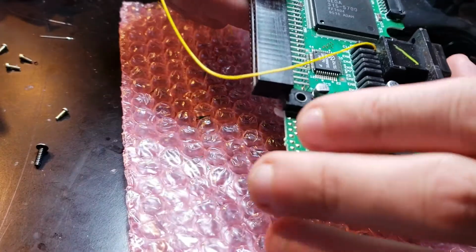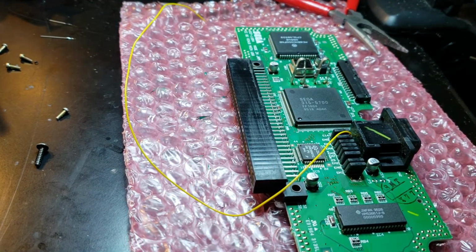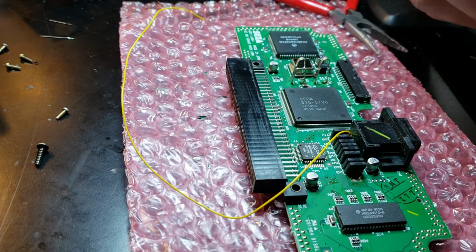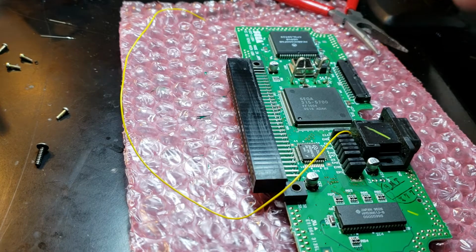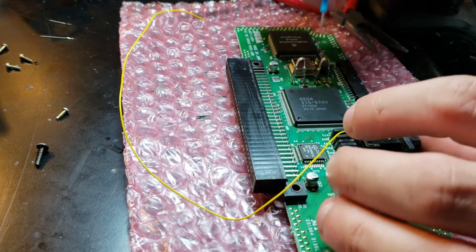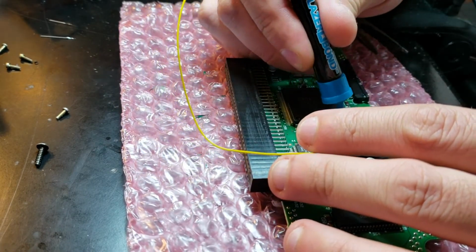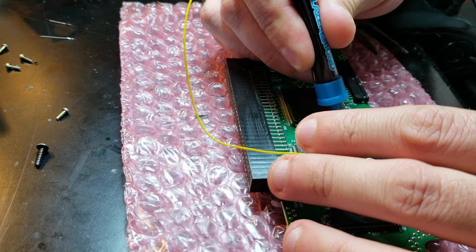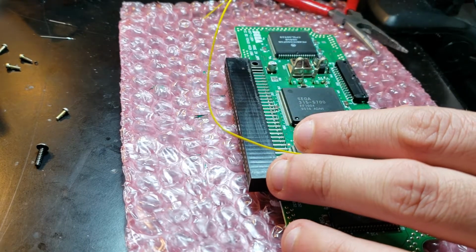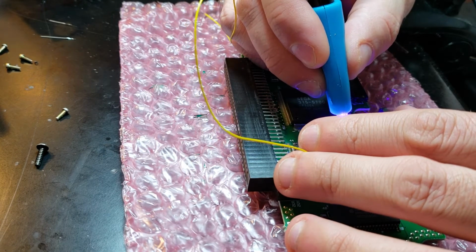But anyway, now that that's there, I'll find this cool little glue guy. I'm not going to glue the pin, but I don't like to put glue on my solder. All I'm really going to do is put the glue around where the wire is, just to give it a little protection. But we're going to keep it off the solder itself and off our chip.